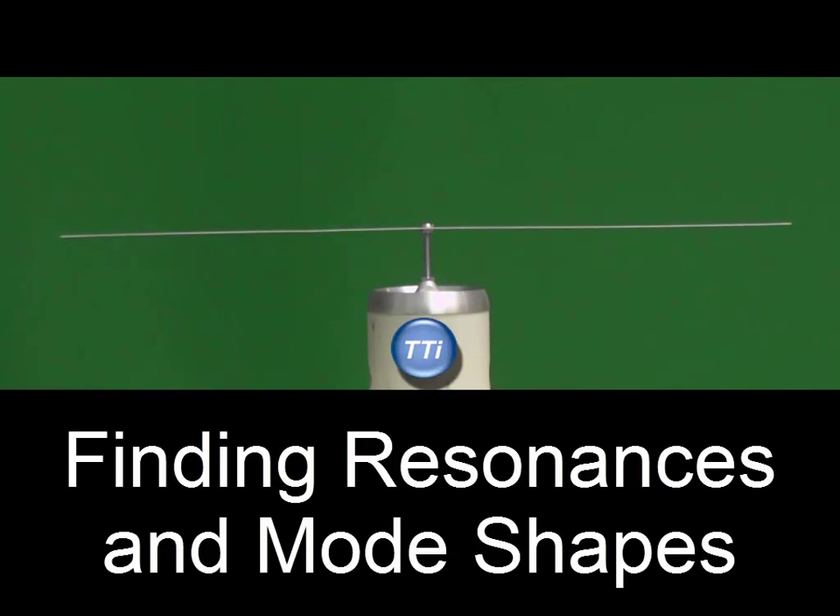We're going to be looking at the vibration of a beam. We have an electrodynamic exciter which is driving this beam at a point in the middle. We've got two beams, one on the left and one on the right. They're both the same. I put two beams on here so that it puts the center of gravity directly over the drive point. If I tried just one beam on one side, the center of gravity would be offset, and when driven, the resulting torque would give us a motion which is not easy to see and is not a cantilever beam.